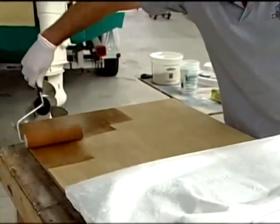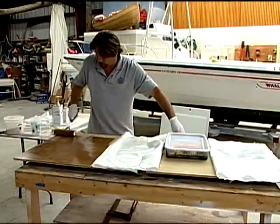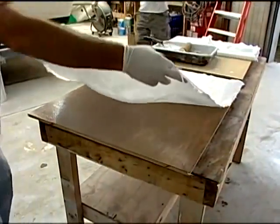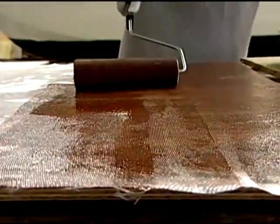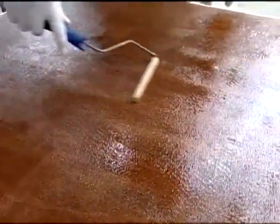These pieces of plywood are relatively thin — three-eighths of an inch. When you add epoxy to wood, does it strengthen the wood? Does it give it more load-bearing capabilities? No, we've put the epoxy on the wood for moisture exclusion. In order to add strength, we are going to use some surf cloth — this is our 745 12-ounce cloth — and we're going to put a layer on the top of the panel and a layer on the bottom. We'll wet out that surf cloth with the West System epoxy and catalyst. A little trick to get the air bubbles out is to invest in a fiberglass roller to roll those things out — we want everything to lay flat.